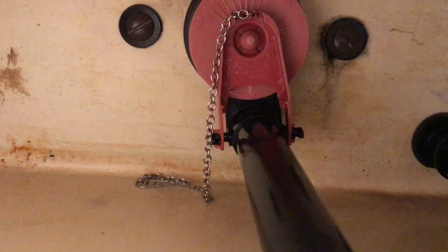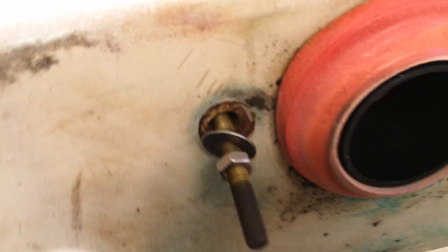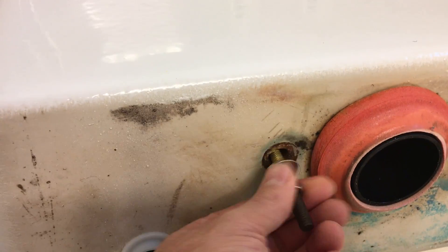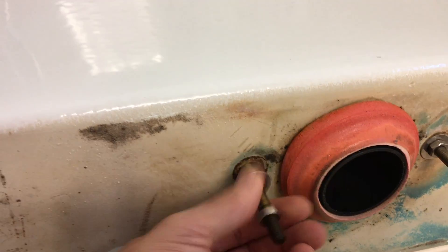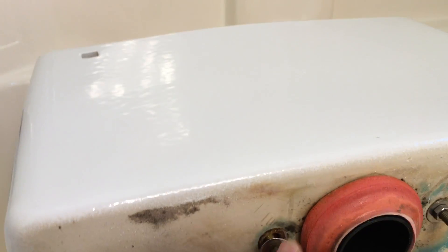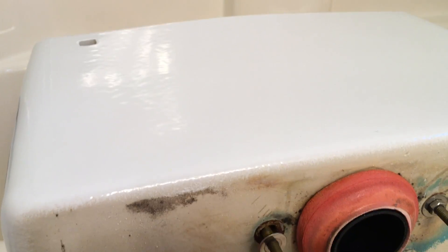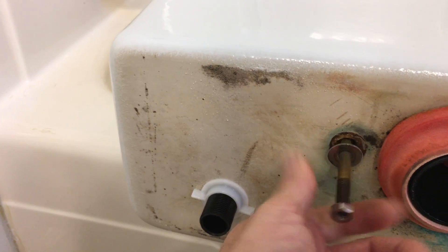You can see the inside as well. Those two bigger flathead screws in the bottom — those are with the gaskets — those tend to go out every now and then. If your tank is leaking a little bit, it's probably those gaskets at the bottom. You can usually get a gasket repair kit to fix all that. I'm going to keep the stainless steel parts because I prefer them, so I'm just gonna take these off and we'll show you the next part of the video.